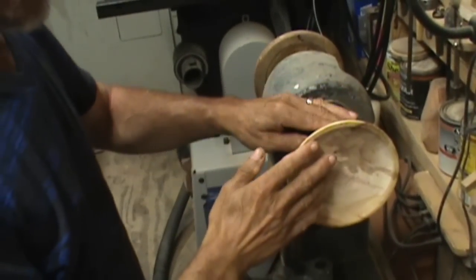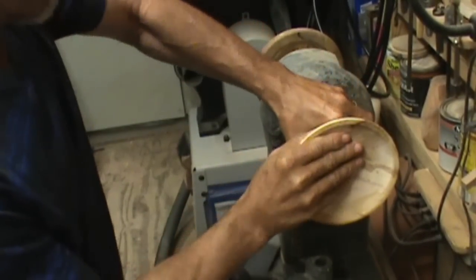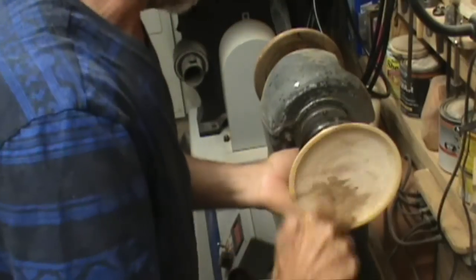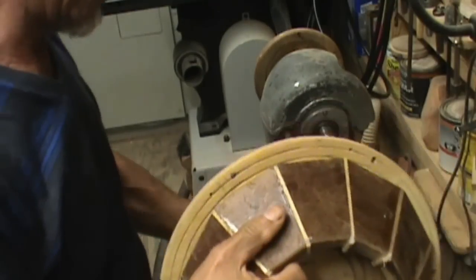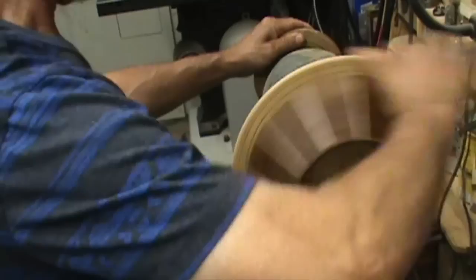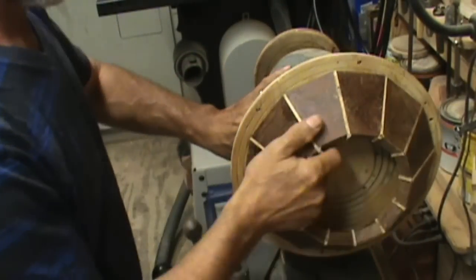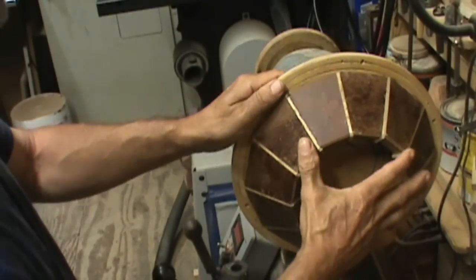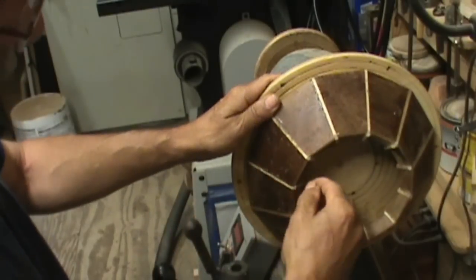I have what I think might be the base for this mounted on here, but I'm not sure. So, we're not going to worry about that because everything should be custom made. So I'll remove this out of the lathe for now, since I got a chuck already mounted on this piece. So I am not able to put up any type of a faceplate, so going to take it easy on the speed. And the first thing that I have to do is make a recess.